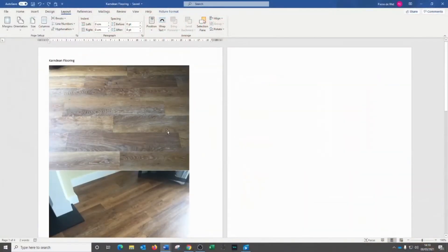That looks beautiful and it's now well protected. So Michael, your question is: can this be done? Yes. To help you at home as much as possible, keep that walk-off mat clean and have some at the doorway. If you've got a coir mat that's quite old, now is the time to change it to catch that dry soil before it comes into the home. If you're like Michael and your floor has been worn down and needs refreshing, we'll come and use a special pad, prepare the floor, clean it thoroughly, let it dry, and then apply a high-quality sacrificial dressing for you. Absolutely we can help you — if you have any further questions, don't hesitate to reach out to us.